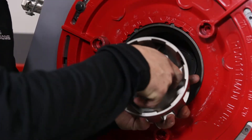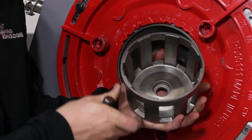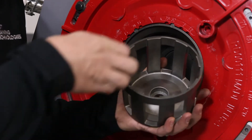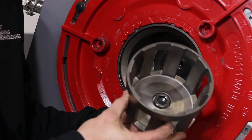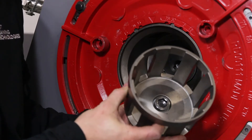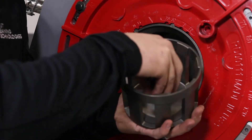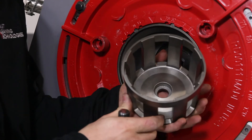The patent-pending Precision Super Alloy impeller is designed to provide a smooth transition with a cast-in impeller bolt locking feature that allows the bolt head to be completely recessed into the body, reducing turbulence within the wheel. Our tool steel alloy is two to three times tougher than traditional impellers, with a wear life approaching three times longer in tough applications.